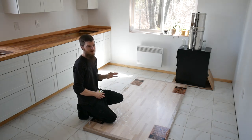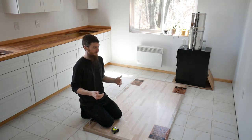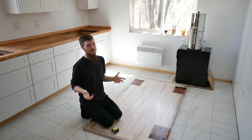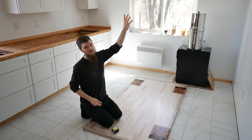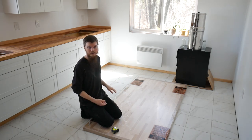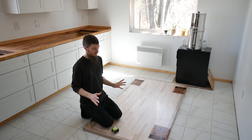That's the biggest table we can put in this space comfortably. When you design a dining space, I think the minimum clearance you want around your table is 30 inches. That's the minimum for you to have chairs around your table and still have room to get in and out without it being too uncomfortable. We're really trying to push the limits and we can fit it at 30 inches on each side and still be centered under the light. So we're going to unwrap this, mark it out, and try to get it cut as straight and evenly as we can.